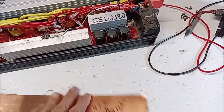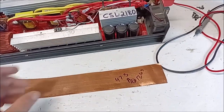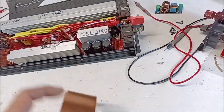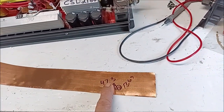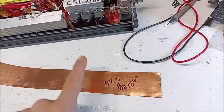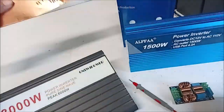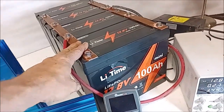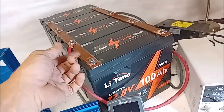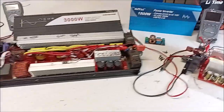My buddy Robert up in Washington sent me a huge 15-pound roll of two and five-eighths copper strips. As it says here, this one-foot length will handle 47.3 amps before any temperature change or resistance occurred, at 13.69 volts. It looks thin but if you fold it up into multiples, I've got a 240-amp capability. Add another four layers and I get over 300 amps, so I can really pull these like I want to.